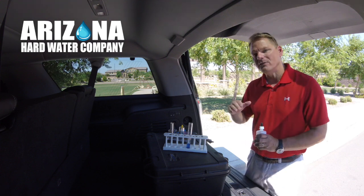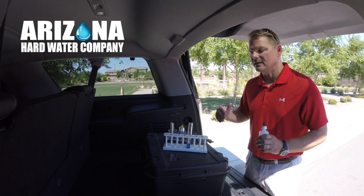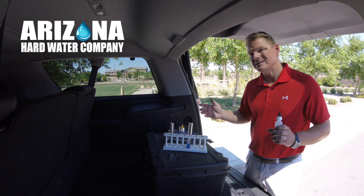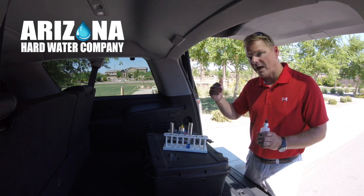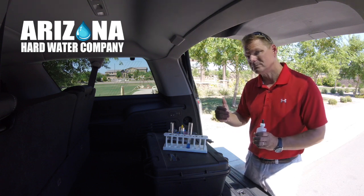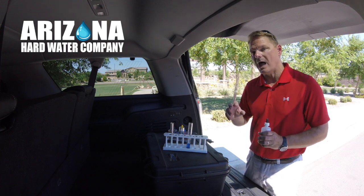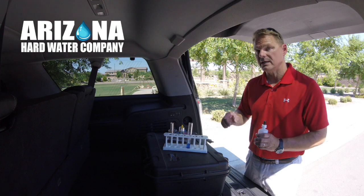What is a safe level of hardness? If it's under 5 grains, a lot of times, and I've had it happen only a couple of times in the Phoenix Valley, I usually say, hey, it's up to you. Your water is still 5 times higher than what soft water would be considered. But it's not off the chart. 21 grains hard, that's off the chart.